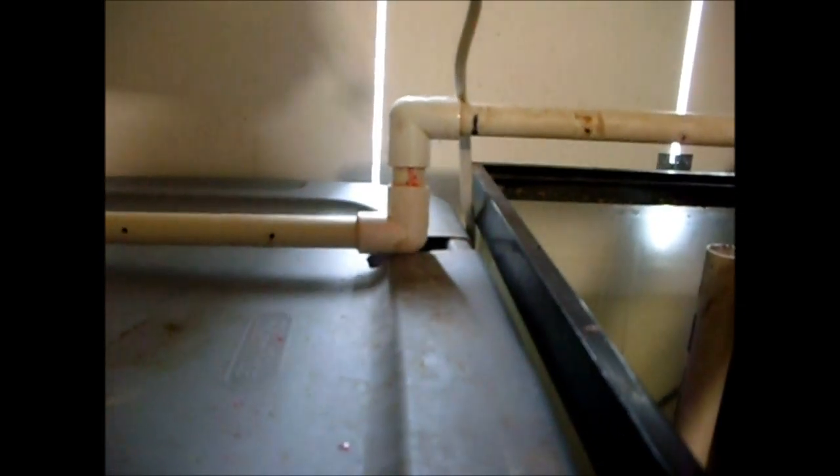If the water level dropped more than a couple inches, boom — the pump stops pumping. It might burn the pump up, but I don't have a flood in my house. So I had this tank and two of these totes set up, with that submersible pump hooked up to a barb fitting to half-inch PVC. The pipe went down in here and then elbowed back up to go over to the third tote.